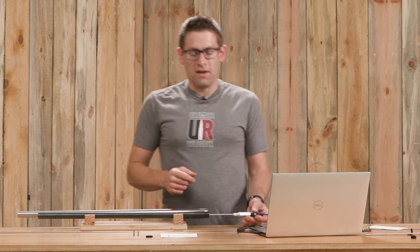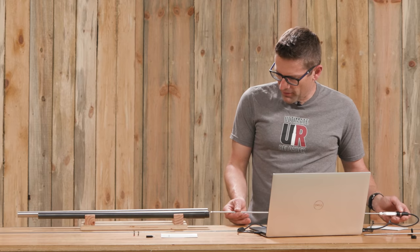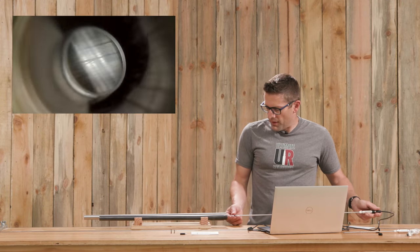Here we're able to get completely out the other end. Let's now see if we're in focus on this other barrel. You can definitely see the difference in quality there. If we rotate it we can take a look at the various lands and grooves at this particular depth. These appear to be lapping marks — we don't have any tooling marks. This is definitely a top quality barrel. The focus worked well for both of these. Our barrel blank is a little bit longer than the 26 inches we have to work with. That is a quick demo for rifle — let's next take a look at pistol.